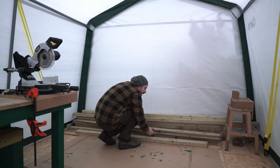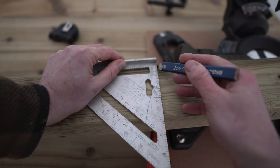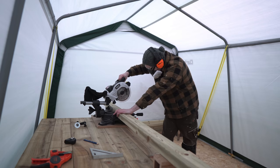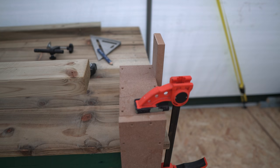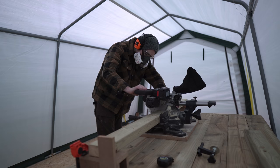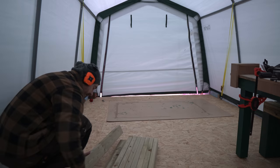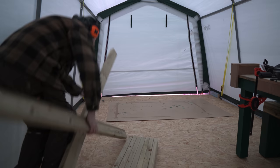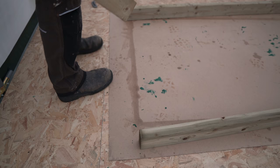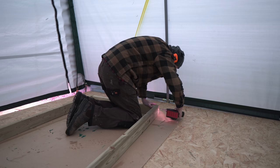I'm going to build it out of some treated 4x2s. I'm using treated wood because it was actually the cheapest available at the time. I'm going to start by building a frame for the top — two long pieces and two short pieces. I work in metric but Imperial is easier to explain here because I'm basing this around cutting sheet goods, which I think of as eight foot by four foot. I'd like a bench that big but I don't have room, so this is going to be six foot by three foot, so a sheet good will hang over a foot at either end and half a foot either side.